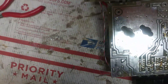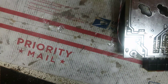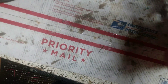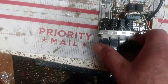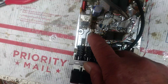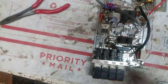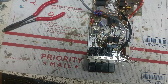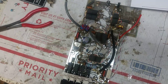You have no burnt traces, which is a good thing — very good. So this thing is salvageable. It does key up. Preamp seems to work. Got a hot resistor right here — I'm going to have to change that. I did a DX500 and it had the cheaper pills in it.